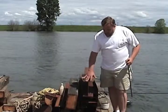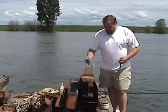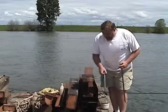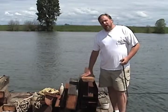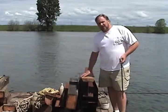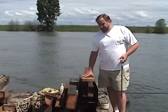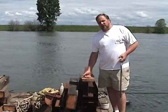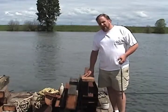What we do when we're done with the steel is we prep it by drilling holes in it for the lags to go through — 10-inch galvanized lags go through the flange like this. That's all done from underneath the house, which saves us from having to pull up flooring or doing any holes with the big pins like on the wood stringers. That kind of offsets the extra cost. Before we install it, we put a wood cap on there so that this goes up underneath the floor joist, and we're allowed to screw this into the floor joist, which helps keep them in place.